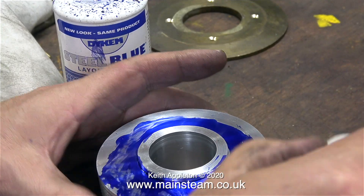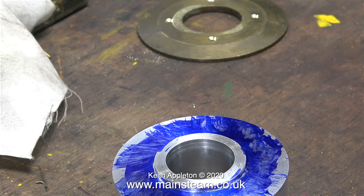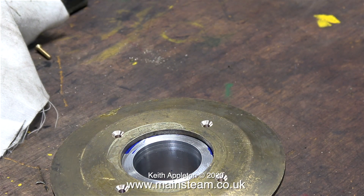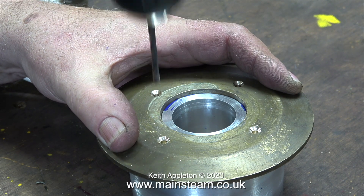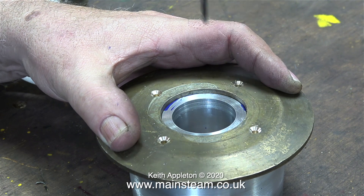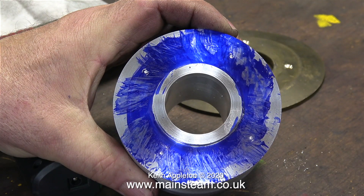The next part involves mounting this brass plate to the top of the aluminium part. I applied some marking out blue and held the part in position scribing through the holes, but then I had a better idea. I fitted a 9/64 twist drill into my small Bosch electric drill — 9/64 is clearance size for a 4BA bolt. I'm holding the piece of brass very firmly against the aluminium and just spotting the holes with the drill bit.